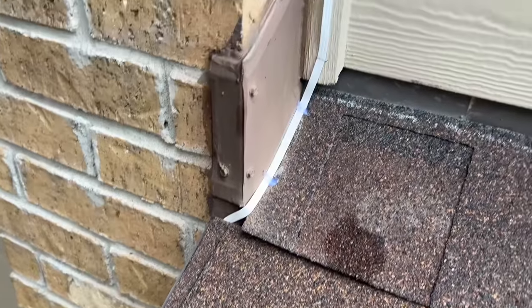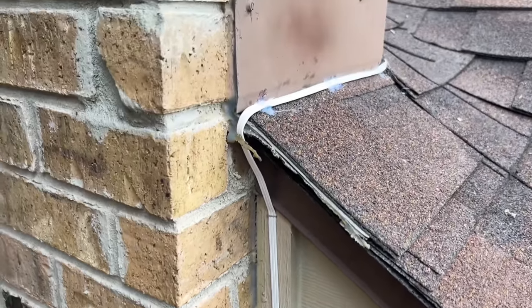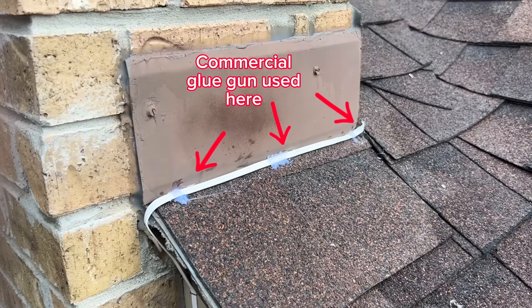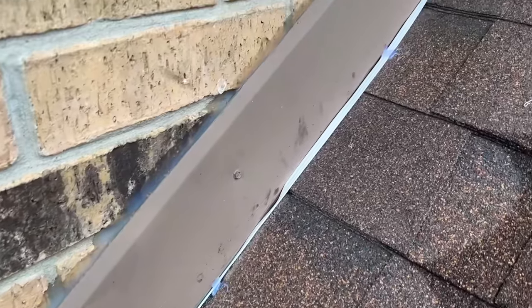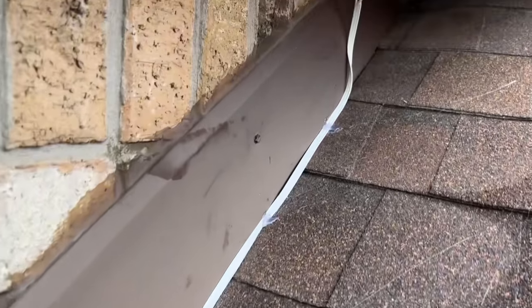There were a total of 8 splices to make this install work. 4 at the 12-foot extension provided by Govee, 2 at the high eaves, and another 2 at the lower eaves. The total linear footage should not exceed 150 feet on a controller and power supply. This includes any custom extensions and the provided 12-foot extension by Govee.